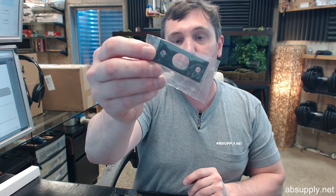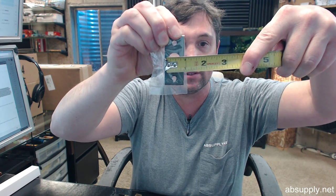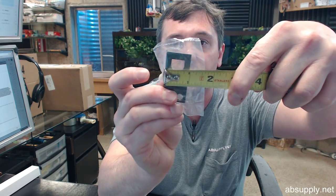You're going to get two plates. You're going to get the flush bolt strike, and I believe that to be about 2 1/4 by 15/16. That's just a strike plate that you'll mount in the header or on the ground or the threshold. Then you're going to have the rod guide, and that rod guide's about 2 inch, just going off memory, 2 inch by 1. You'll notice the hole for the bolt head is D-shaped.